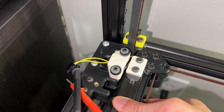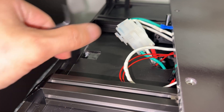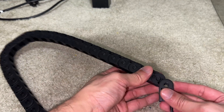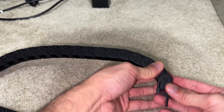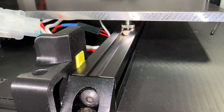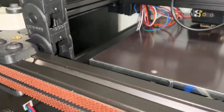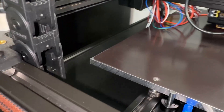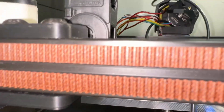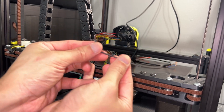Hold off on readjusting the Z endstop and bed until later. For CAN bus, you still need a Z cable chain for the AB motor and Y endstop wires. The cable chain has 2 ends that need to be snapped on like Legos — there is a proper orientation of both the chain and the ends. For the bottom mount, push it hard against the bed extrusion to hold the yellow piece in place, then screw it down from the other side. These chains have covers that pop open, which make wiring a lot easier. However, the covers are hard to pop open — I had luck using a 2mm Allen key and brute force.